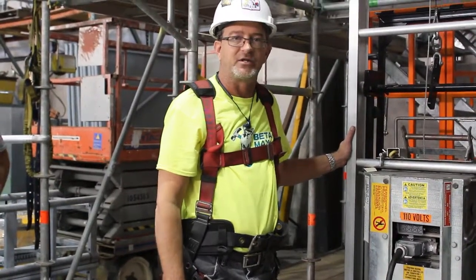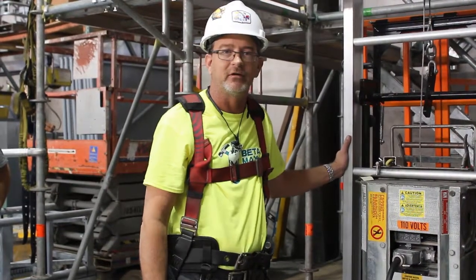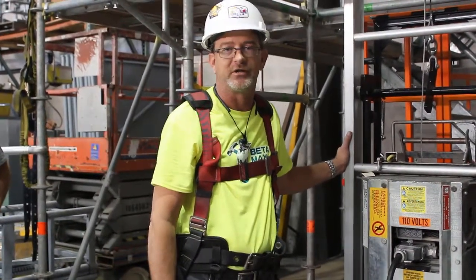By taking a few extra minutes to ensure that the wire rope is routed correctly and the twist is taken out periodically, you can alleviate most of the problems associated with using this type of system.